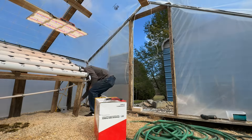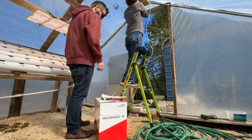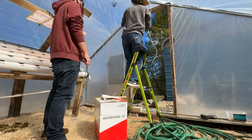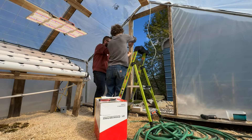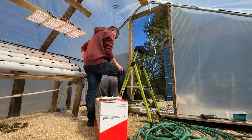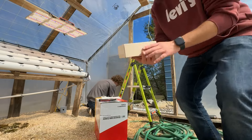We then begin running Structured Cable Products white Cat6 cable inside of the greenhouse to where we're going to be hanging the access point. We run the cable to where our power source is, where we'll place the POE injector and connect it to the line from the shop. We put a couple of tacks and zip ties to keep the wire tied down to the structure. This quality of install is just good for us — not particularly for a client — this is all for personal use on a tight budget.